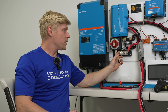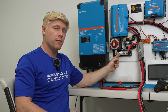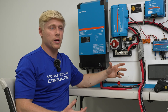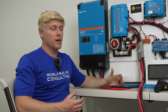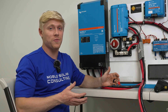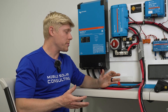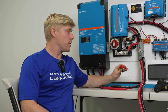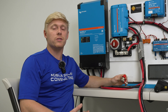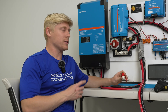We've got non-bundled cables here and this is a 1-0 wire, so we've got a 300 amp fuse for the Class T and a 300 amp fuse for the MRBF. Our main objective today is just to compare how hot they get — we're not going to be testing their amperage interrupt capacity. Both the MRBF holder and the Class T holder are UL listed, meaning Underwriters Laboratory has tested them and confirmed they meet that 10,000 and 20,000 amp rating.